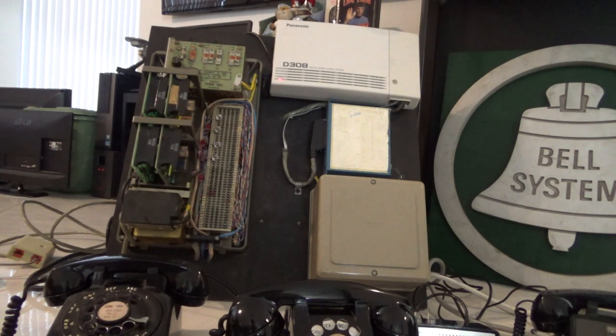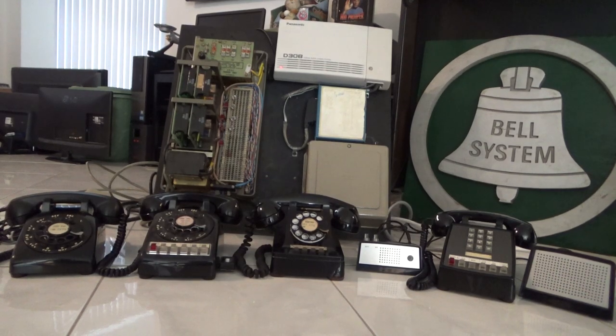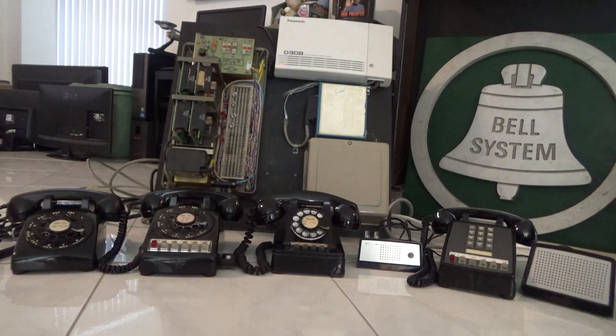Before the demonstration, I have four stations hooked up to the 551 KSU. Starting with the set on the left — that's a Western Electric 502, which is a single-line phone, essentially a 500 set with a lead control. A lead control signals the system to let other users know a line is in use when going off hook. That phone is currently hooked up to line four, so when going off hook it will illuminate the line four position on the six-button sets.